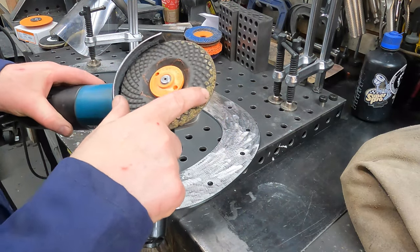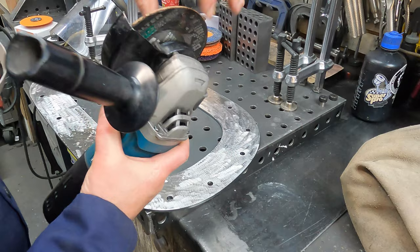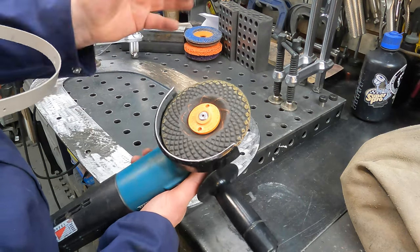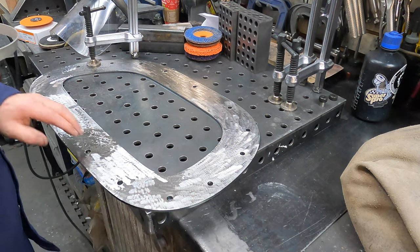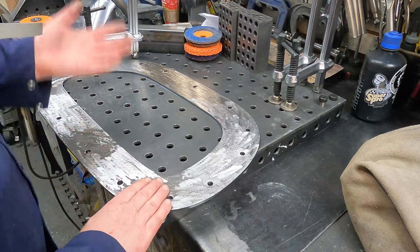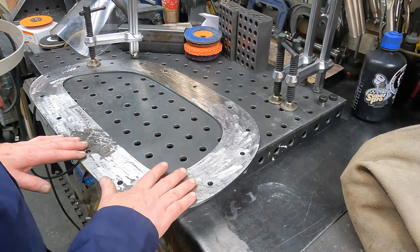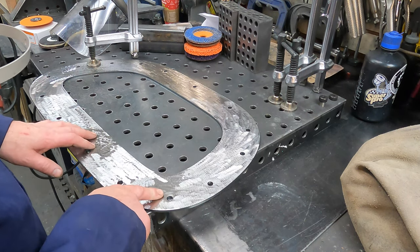So we're done with the Flex Cut test. A little bit of plastic on the attached nut was caught and making the wheel not flat — that was my mistake. The result left a lot rougher finish than I was hoping for. It's a 36-grit disc, so it's going to do that, and half the bad finish is me. But that's what you can expect. It never once clogged and it peels through the heavy mill scale like butter — you have to be quite careful. But the surface finish is completely unacceptable as a final finish for most purposes. We're going to come back in, surface-prep this again to smooth it out and see how it looks.